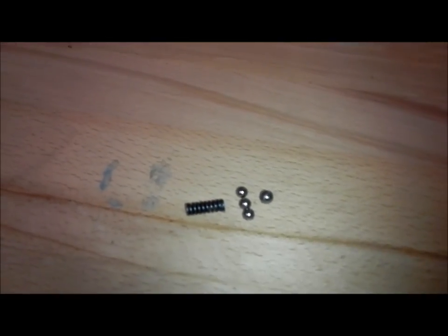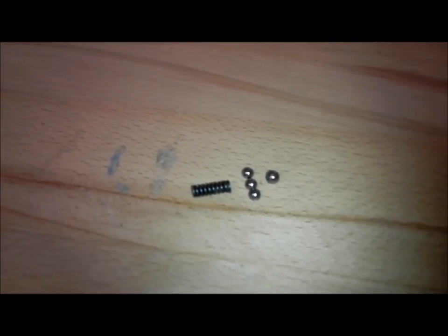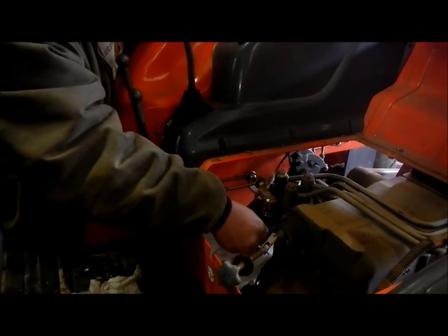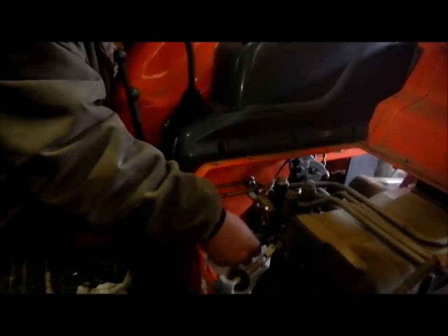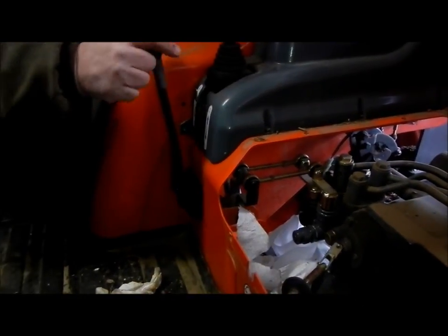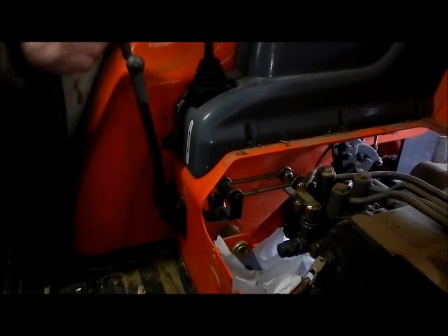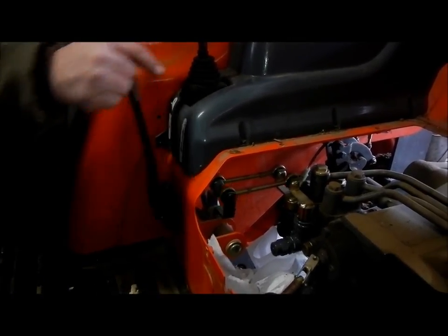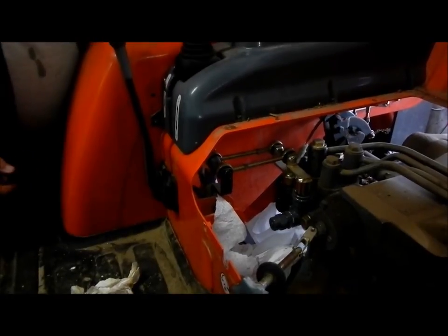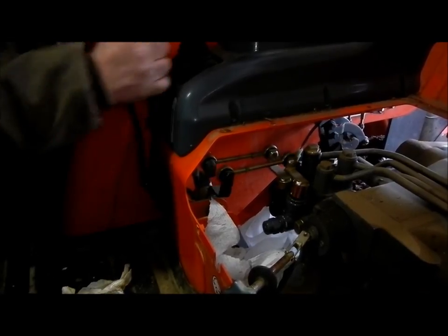So that's what was removed from the valve. Now we're going to put the cover back on the valve and put it all back together. You can see we've got our cover back on the valve — it's tight — and the function of the valve does not stick in position anymore, so it works just like the other one: spring return to neutral, just the way we want it. That's what we did to take the detent balls out of that valve to get it to operate and not stay on.